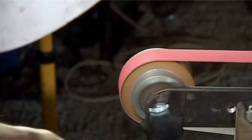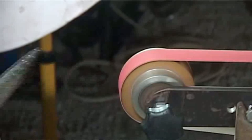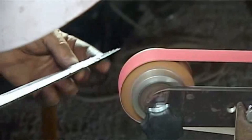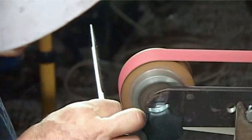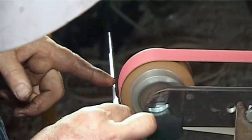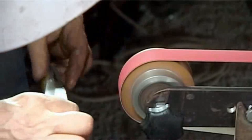Can you remember this on our broad flat grinding platens? The two-inch dip, it's called. You know, the mistake that they've given a name. It's so common. Now, in this case, your belt is 25 millimeters wide. If you constantly start your grind at the same place, you're going to slowly, slowly, over time, create a dip, possibly with the opposite corner of the belt. You're so busy concentrating at the plunge, you forget the fact that it's grinding on the other side of the wheel as well. So if you start just a little bit down the blade and move to the left, start right down the blade, move to the right, that's going to mix things up just a little bit, so that you never land up with a dip.